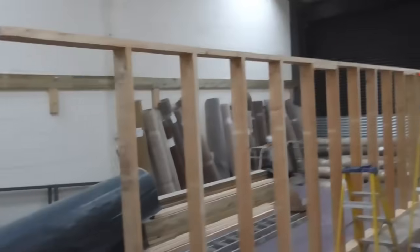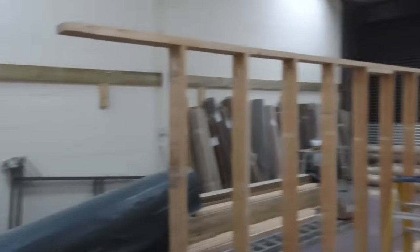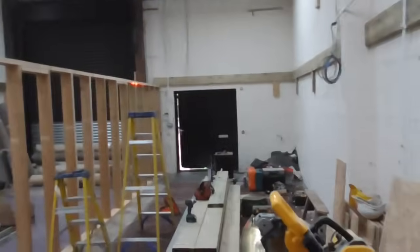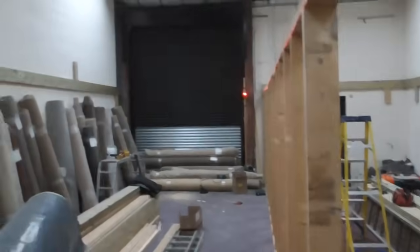And I'm spinning around, sorry. We haven't got a plan, obviously, we're making it up as we go along, but we're not quite sure where this door's going to go. But with that wall in now, we've got all of our points, apart from this end bit, which he's going to have a think about tonight, and we'll probably know what we're doing with tomorrow. But in terms of all the resin, that's all in, all our 3 points we're working to are in: the external wall, the party wall, and the central wall. So it's a relatively simple job now, as I said, washers and nuts on the resin bolts, which we'll do tomorrow, and then we can physically start joisting it out. So we should start to really come together quite quickly.